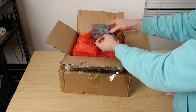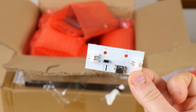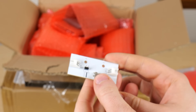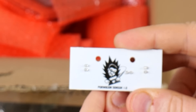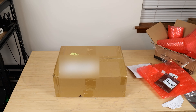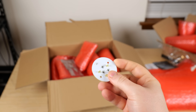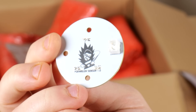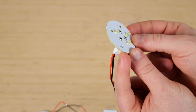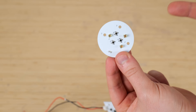Now let's see how those PCBs turned out. Oh, these look clean. So this is the power board for the two sensor lights — you'll plug one into this side, one into this side. USB-C. And look at that — it's me. I guess I have a whole bunch of these now, so gotta figure out what to do with that. And here's one of the light boards with the infrared lights on them, and it just came out so good. Now, I realized I had some screw ups, like reversing the positive and negative on the breakout boards, and I could have clumped the LEDs a lot closer to each other. But hey, it was my first time, so I'm totally okay with doing a redesign down the line.